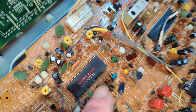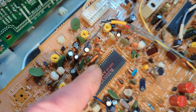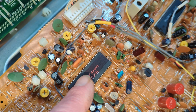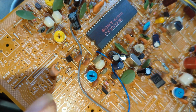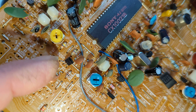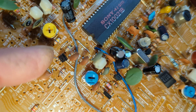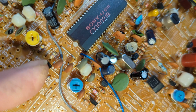Everything is perfect actually. Playback is still a problem though. So looking at the circuit diagram, looking at the waveforms first of all, it's basically chroma gets turned off on pin, if I'm remembering right, yes, 37. Chroma is switched off. There's nothing there when you play back. I can see the voltage to this transistor should be something like 3 volts, 3.5 volts, can't remember off the top of my head now. It's actually about 0.6. When I put it in record, it's reading the right voltage.